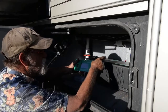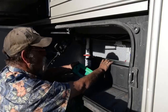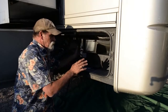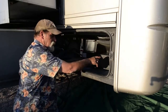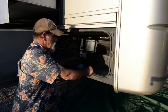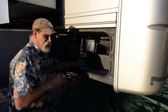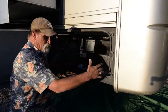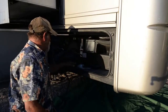We've also disconnected the AC power for the in-house battery charger so it's no longer in the system. The system takes care of all of it - inverter, charger, solar controller. We've tested everything, everything works. Now comes the cleanup: get everything bolted down, mount the unit permanently to the floor, seal up all the excess cable accesses, cap off the 12-volt lugs, go up on the roof and put a bead of sealant around both panels so wind and water can't get under them, seal up the refrigerator cap top vent, and we're going to call it a day.